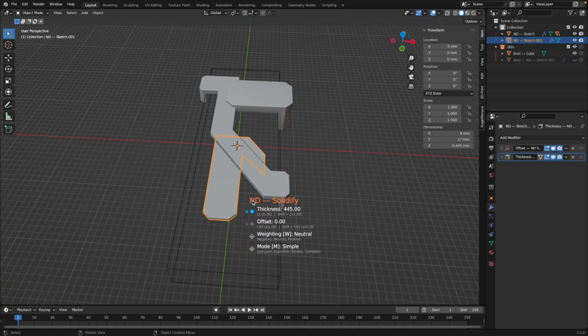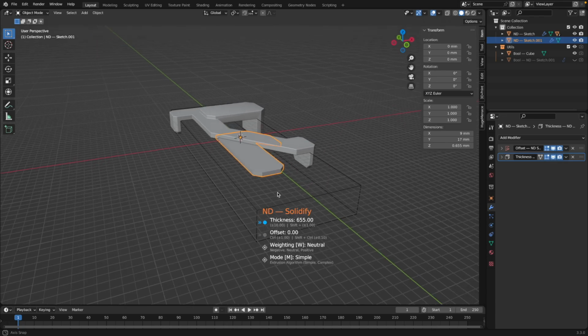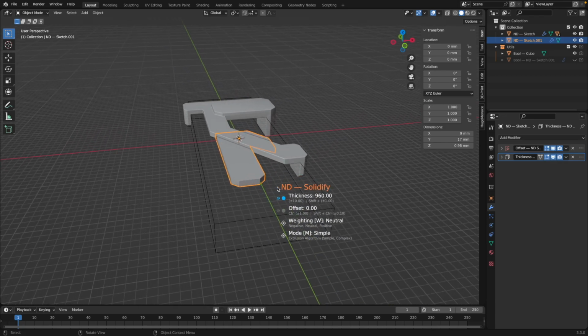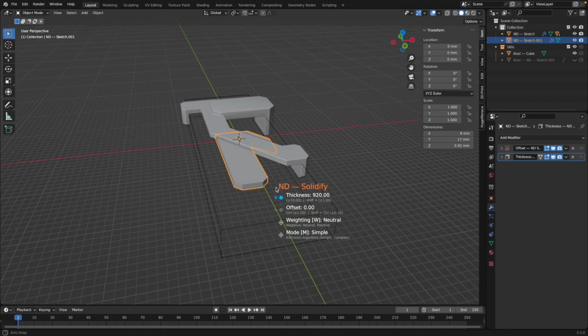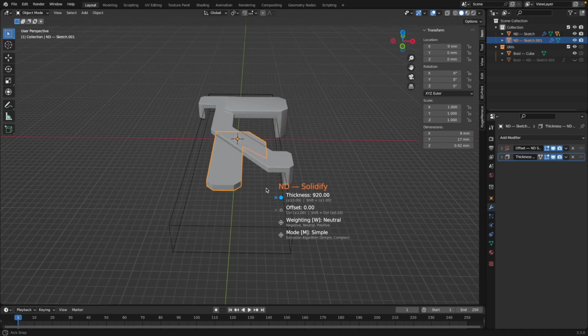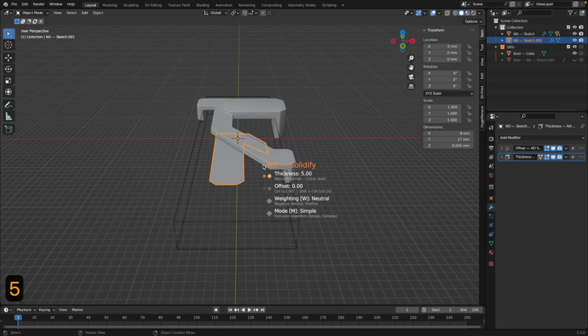And pretty sure that the thickness of the part itself we made last time was 1 millimeter. And I think I also said at that time that I try to avoid making structural bits that are thinner than 1 millimeter, just because I want to make sure that they print nice and solid and that there isn't any warping or problems with them. However, I want this to be definitely shorter than the 1 millimeter part there. So I'm actually going to make this just 0.5 millimeter.